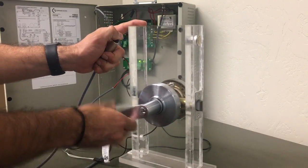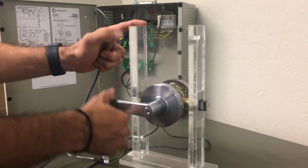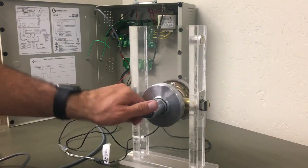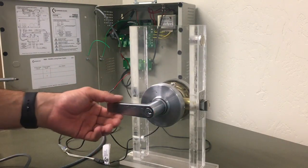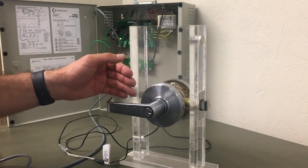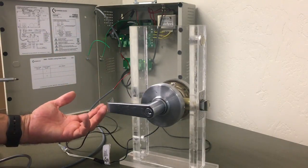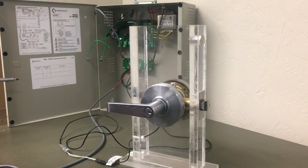No power — clutching. Apply power to retract the latch. We can see here the CRU 3 just plugging into a 12 volt solenoid is going to cool off those coils and extend the life of the solenoid. It's ideal for fail-safe or continuous-on applications. To see how to fine-tune the CRU 3, stay tuned.